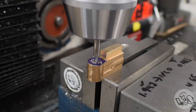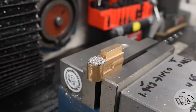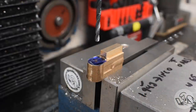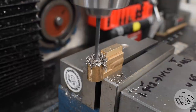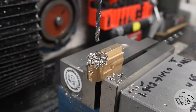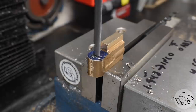Center drill time. My grip on the part isn't very good so I'm going up in a lot of really small drill stages to minimize drill pressure. Lots of fluid and I've got a small pilot drill, then I'm going to work my way up in a whole bunch of stages - many more than I would normally use for such a simple hole. I just really don't trust the grip I have on that leg with the part hanging off the end of the vise like this, so I'm doing everything I can to make sure that part doesn't move.